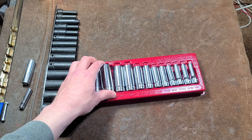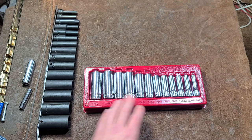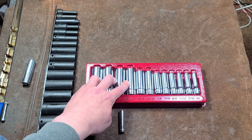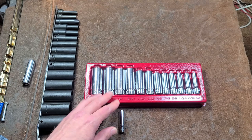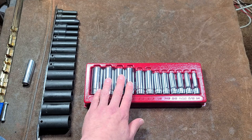On shallow sockets they'll have varying sizes because as you go up to larger fasteners you want a little deeper socket to make sure you have full grip. That's not an issue with deep wells. There are standards: 2 inches or 50mm for quarter-inch, 63-65mm or 2.5 inches for 3/8-inch drive sockets, and half-inch drive chrome sockets would be 3 inches for deep wells. But what they've done here is made them all different sizes, whereas the impact sockets are all a standard 2.5 inches tall.